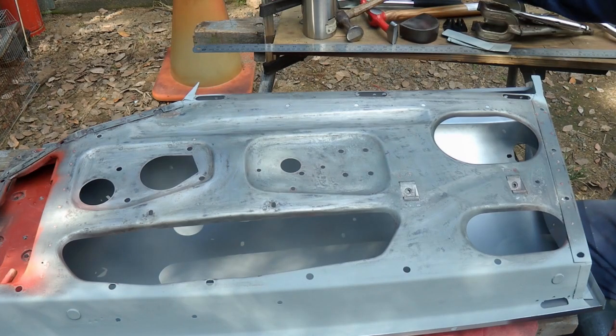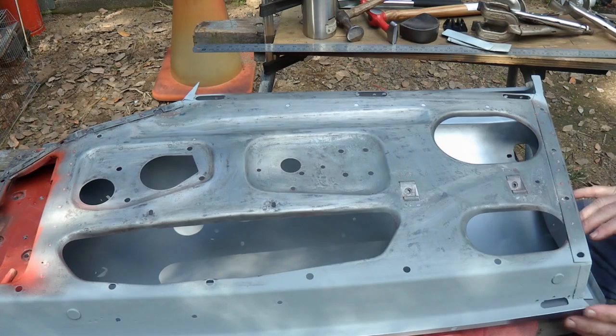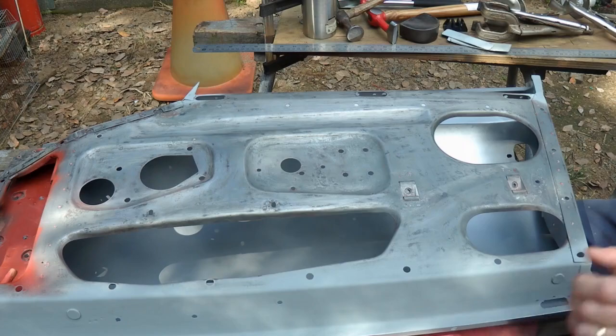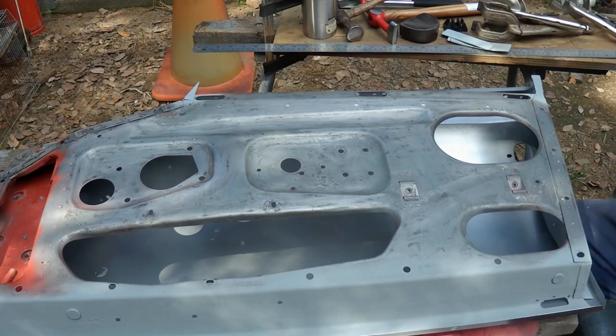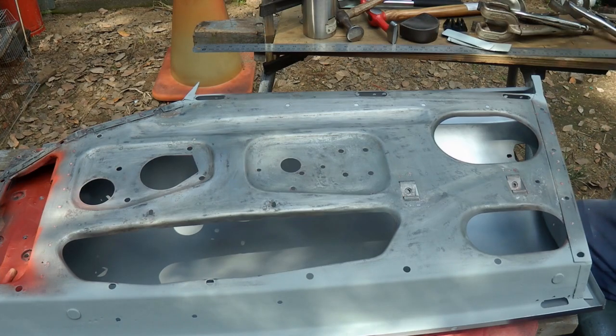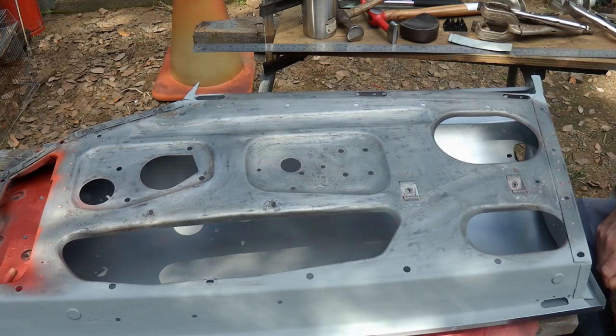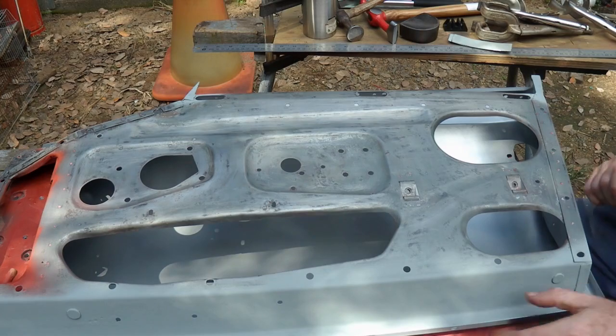The history of how they were done is that the car was modified in terms of lead loading to fit a door. So it's not a case of when you've taken the old skin off, you put a new skin on and it's going to go back and fit exactly the same. Chuck Hadley goes into a lot of that history and explains some of the modifications you might have to make to the re-skinned door to make it fit the car — particularly on the shut end, and more importantly where it more than likely isn't going to fit, around the area where a lot of lead loading was done at the factory. It's handy to know that when you're putting something together.